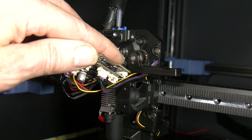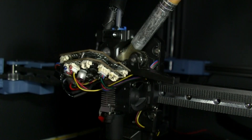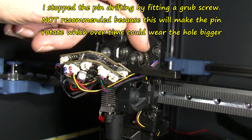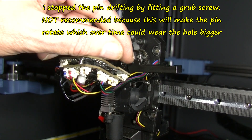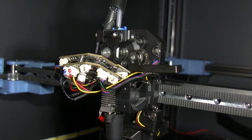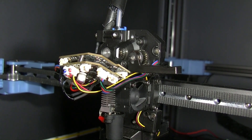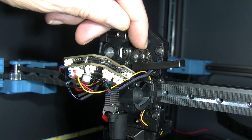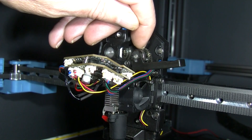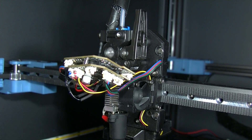Sometimes you get a bit of dark filament in here, so I am just showing this paintbrush to clean it out. I have taken this screw out. I am just going to rely on a tiny bit of super glue on the edge of the pin, and put the pin in as I push it in. Make absolutely sure that the yellow cogwheel can rotate freely.